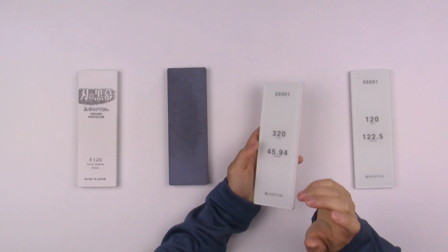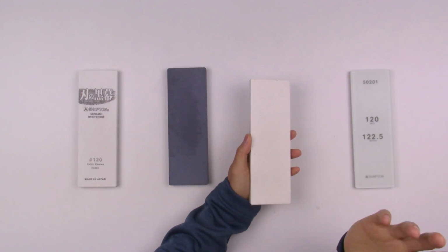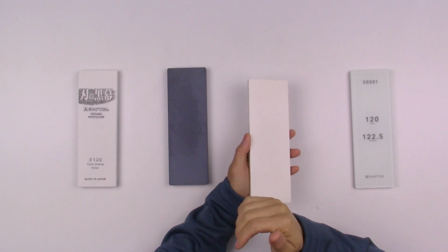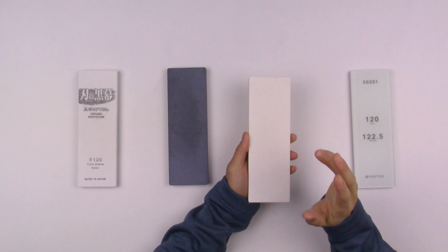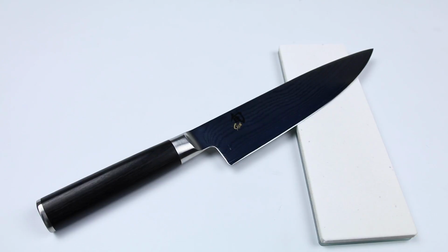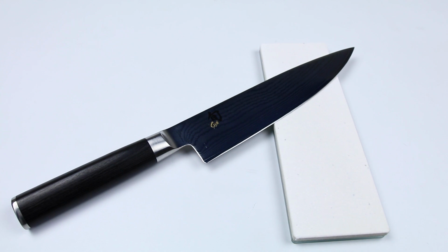This is the first. All the knives were able to achieve a really clean edge from the low end, on the knives with the 55 Rockwell scale to the 66 knives. And that's something that is really fantastic about this stone. You have good speed, you have excellent tactile feedback, and wear is actually very, very slow.